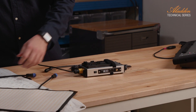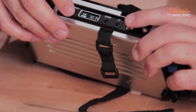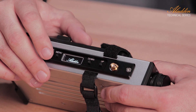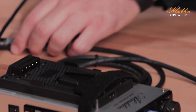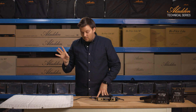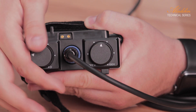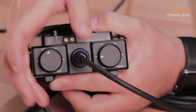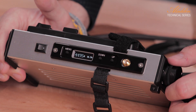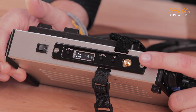If you want to use it with the Fabric Light, you can put two Biflex units side by side. Go through the menu, set to Fabric 200, the dimmer restarts, and plug in the fabric — you have full control. For controlling the panels there are two large dimming knobs: one for intensity and one for color temperature, ranging from about 2900 to 6100 Kelvin, with the dimming percentage shown on the display.